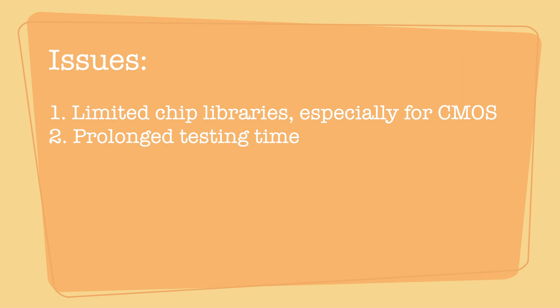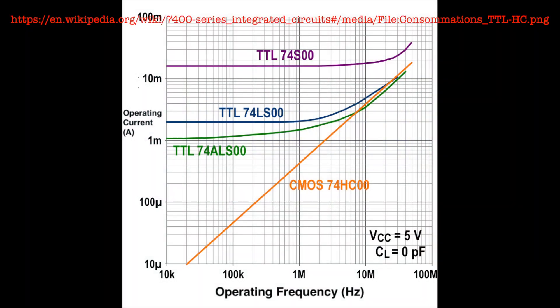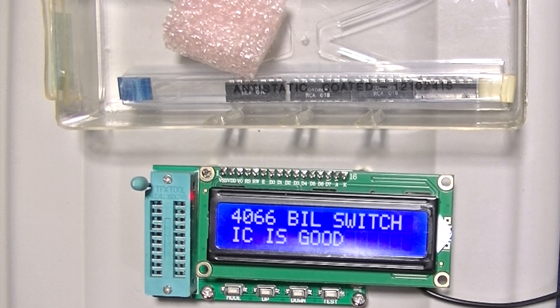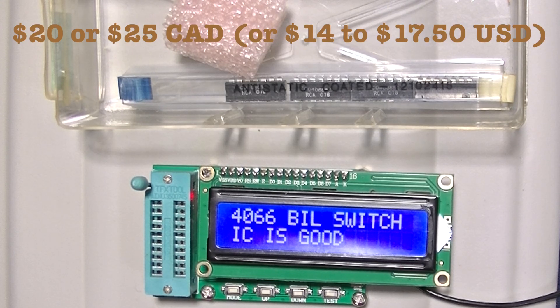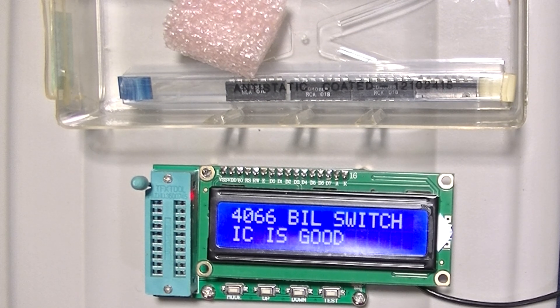There's no information on the actual testing parameters — that is, whether the test is carried out more than once, as it should be, and at what speed the pulses are sent. Given that most CMOS and TTL normally operate in the megahertz range, that's where the testing should be if the tests are going to be realistic. For this reason, I'm going to give this tester a fail, certainly at the $35 price point. If it were less — say $20 or $25 — then I'd say yeah, with all the weaknesses, go for it. But at $35, I don't think so. It's not worth it.